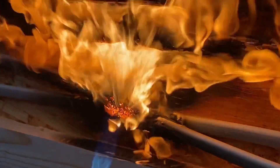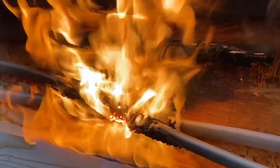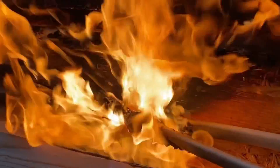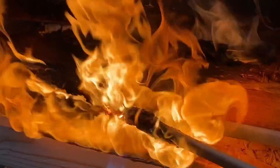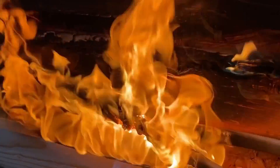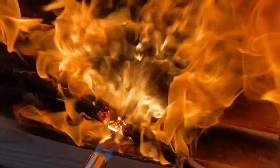Now what's the importance here Gary of what we're seeing? Why do we use metallic clips? Surface wiring systems need to be supported for the longest possible amount of time in the event of a fire to prevent entanglement — maybe of people coming in as part of rescuing. Firefighters will be coming into a building, and that surface wiring system needs to be held in place so it doesn't fall down and cause entanglement. We can see how that PVC clip, even though it had the nail at the bottom, collapsed very quickly — the other two are supporting the cables perfectly.